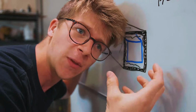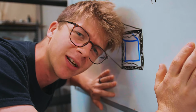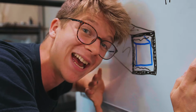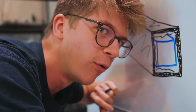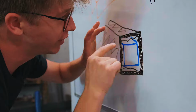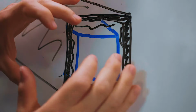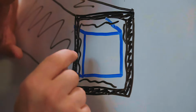So we got it all welded together. It feels pretty solid. The powder has consolidated into a solid thing, which is mind-blowing, frankly, that powder can become solid without it actually becoming liquid. Power of forge welding, something special indeed. Anyway, you'll see as we're forging that the jacket of mild steel around it is kind of bubbling around as we go, which shows the oxidized stainless foil is doing its job of keeping it separate from the powder.